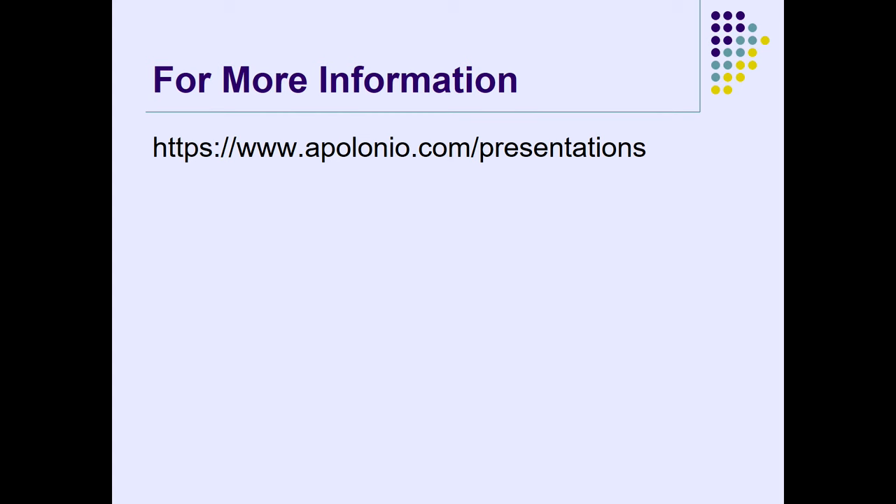You don't have to open up a port — that's my thing. That's what I was trying to illustrate. On suppressing signals: the transmitters do send the 24-bit ID. You could set up a table of 24-bit codes unique to your setup and exclude everything else. That's what I do — I exclude stuff at the microcontroller level. So when it hits my server, I don't get all the stuff my neighbors use.